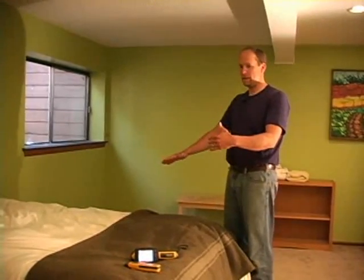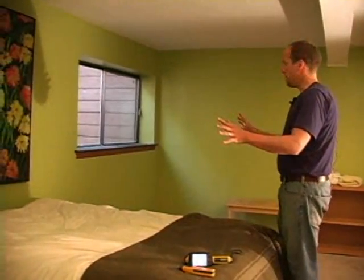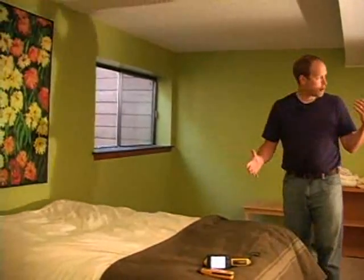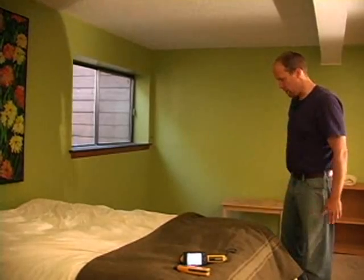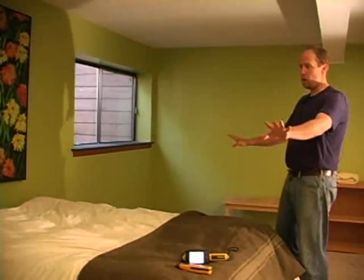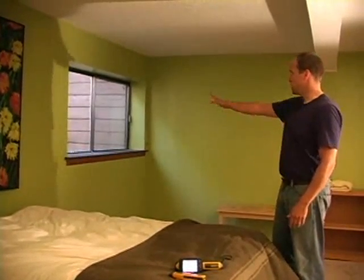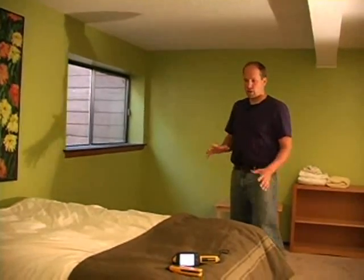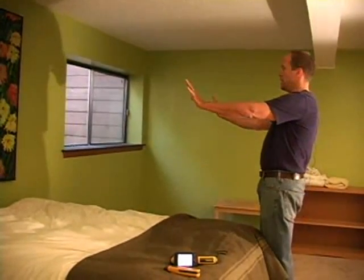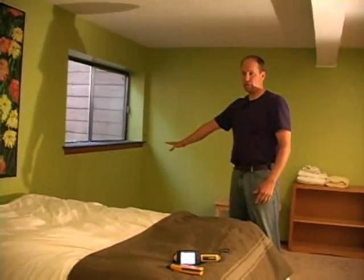So we're down in the basement, and when you do an inspection, you have to orient yourself when you come down the stairs to the basement, especially when you're looking for moisture. You have to know what the exterior walls are. So in this part of the bedroom, well, this is a bedroom, even though technically by code and standard it's not a bedroom, doesn't have a closet, but it's definitely being used as a bedroom. And these finished walls here, this is a great place for moisture inspection, especially with the window well. This sometimes collects a lot of water. So this is the rear wall to orient yourself. Rear exterior wall, window well, great place to look for moisture.